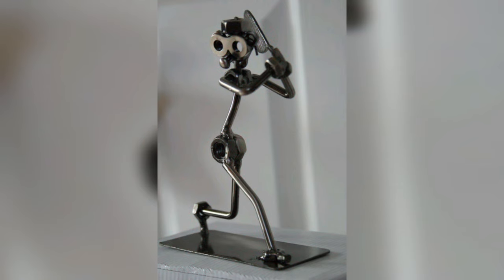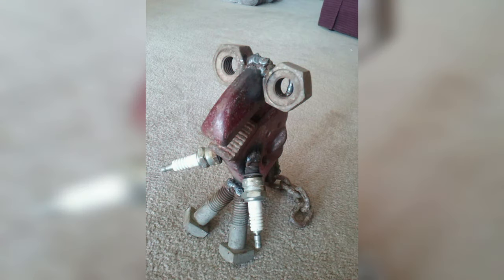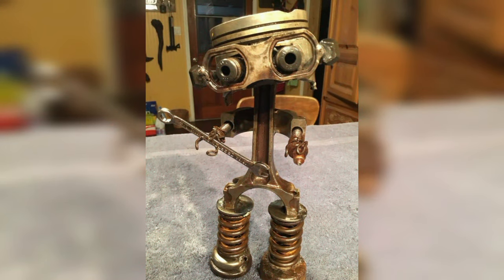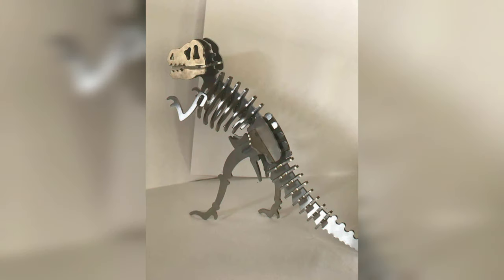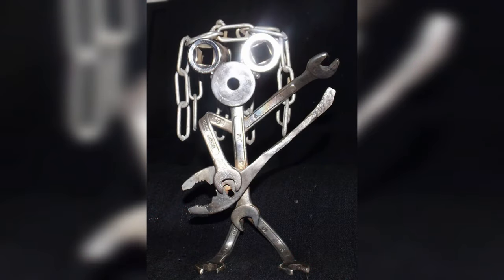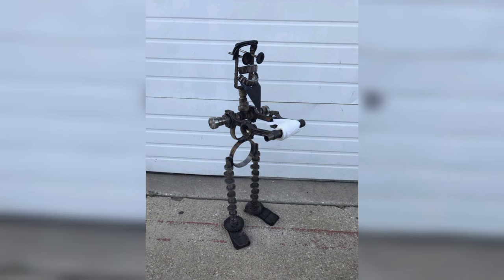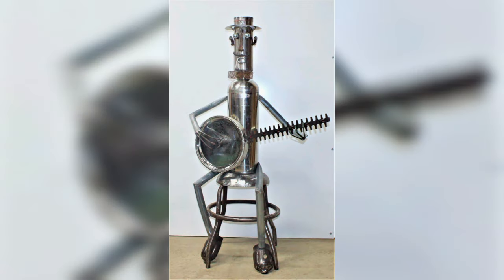Practice various welding techniques such as butt joint, lap joint, T-joint, fillet weld. Each of these techniques has its own challenges and applications. Learning and mastering these techniques will make you a more versatile welder. Proper joint preparation is essential for a successful weld. Clean and grind the metal surface to remove rust, paint and contamination. Be sure to fit the pieces tightly and secure them with clamps and magnets before welding.